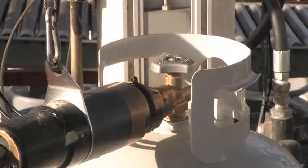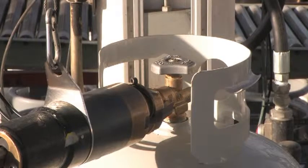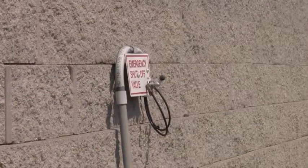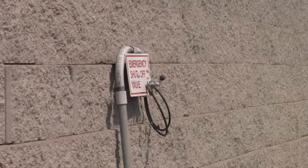Automatic shutdown systems normally consist of a sensor or trip lever mounted on the balance beam of a scale and a master control valve that stops the flow of liquid propane to the dispensing hose. The dispenser tank may be equipped with an internal excess flow valve in combination with a positive shutoff valve. Internal valves that incorporate excess flow protection are also common and may include thermal and remote shutoff capabilities. Remote shutdown stations may also be installed to provide a greater level of emergency support away from the pump and transfer location.